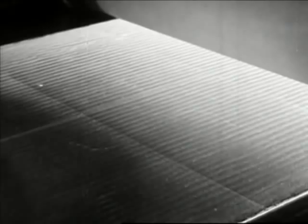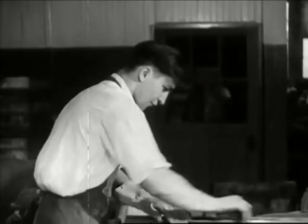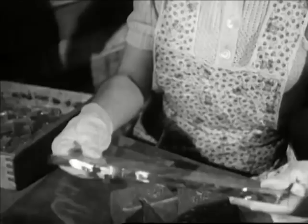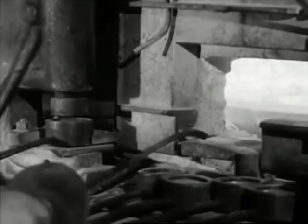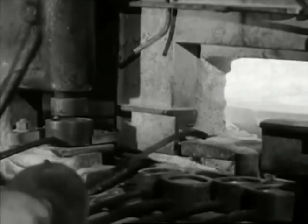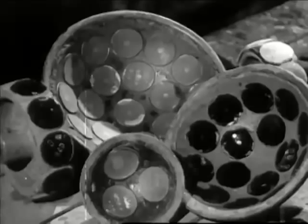After cooling, large sheets are cut down to sections, each section subdivided into squares, each square about the size of an eyeglass lens. Reheated and pressed into molds, the squares become lens blanks. In special ovens, they're slowly cooled and then cemented to blocks, shaped to fit the curvatures of various types of lenses.